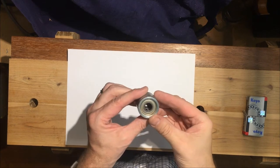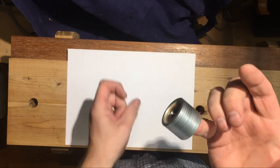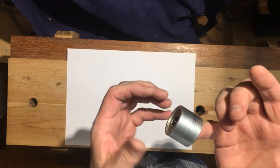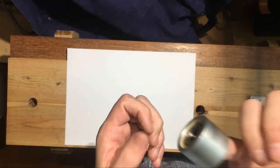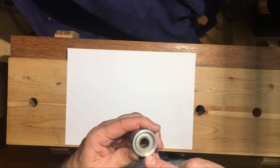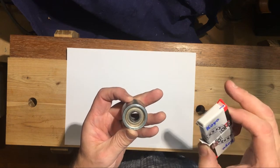We've previously covered the need to replace these bearings. You can feel that it's quite scratchy - it's not spinning freely. That one's a bit better, a bit more freely spinning, but still a little bit scratchy. This one's definitely scratchy. I'm going to replace those. Not sure what they are in terms of brand - it says 'Ahead'. I don't know that brand, and a quick internet search couldn't find them.